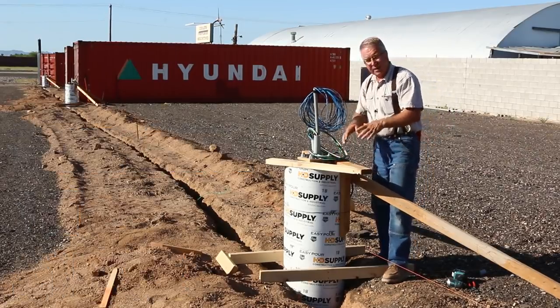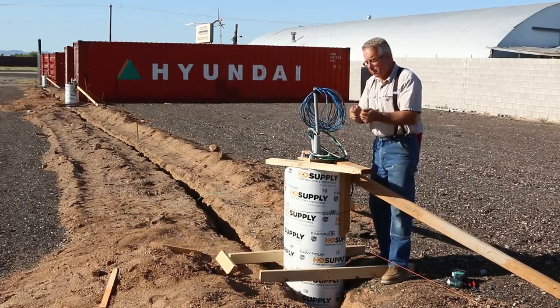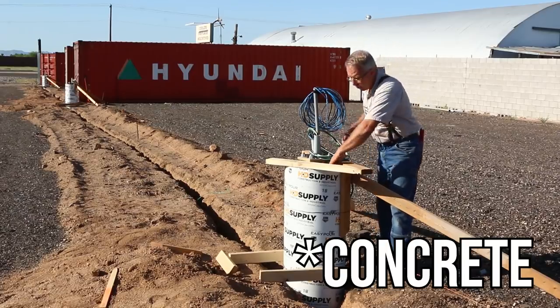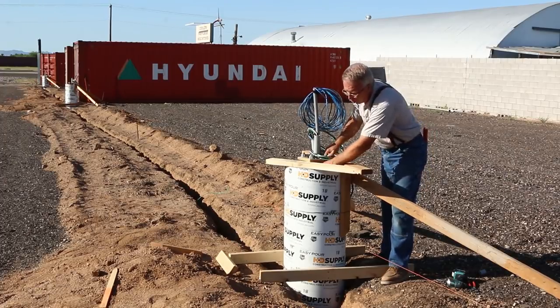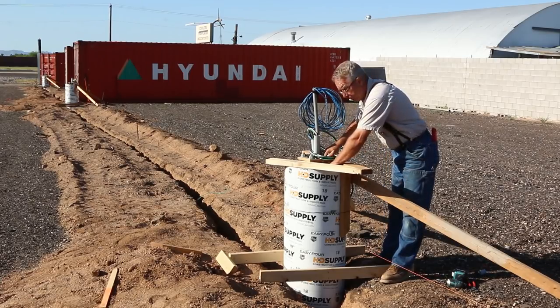The rebar is set in the right position down below grade, and then will be plumb, or clearance will be maintained as the dirt is going in. I don't really have anything in here holding the location of the rebar, so that's going to be taken care of as the concrete's placed. The bolt templates hold the rebar assembly inside the circumference of the rebar cage.